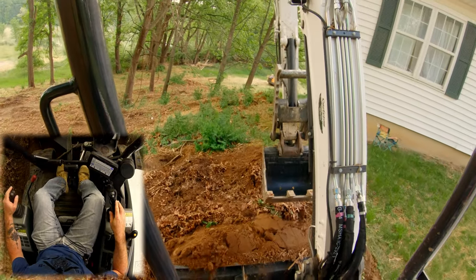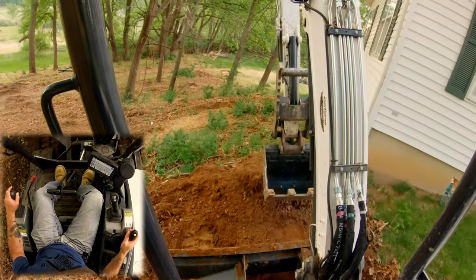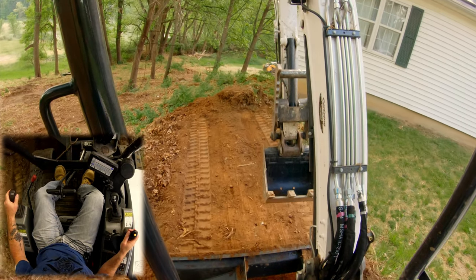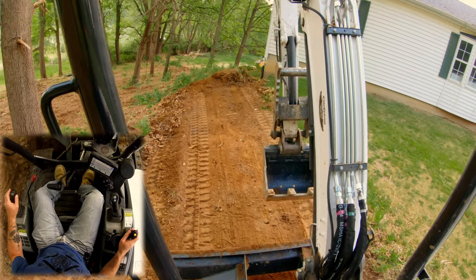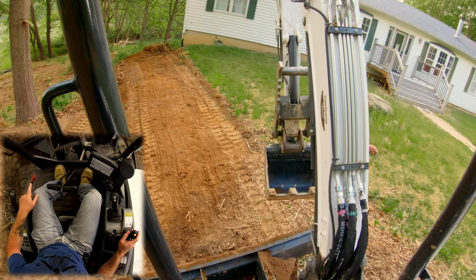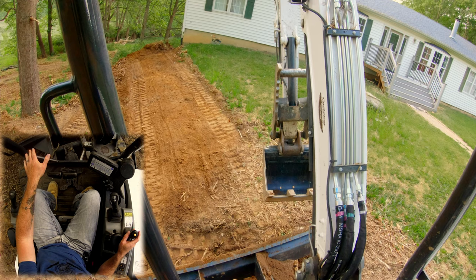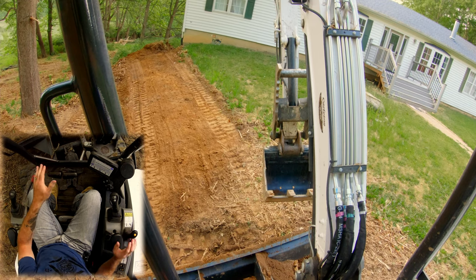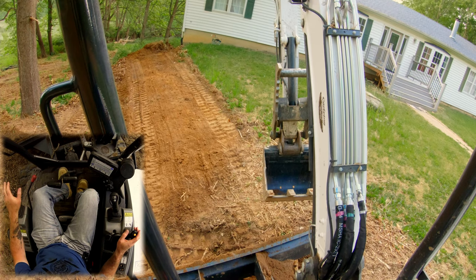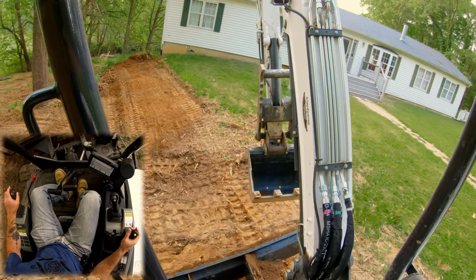I was trying to keep my boom down a little bit. They do have a gutter downspout there, I need to pay attention to that. A quick tip when you're grading with the blade of a mini: you can see there's a hard angle transitioning from the yard to the new slope I just cut in. What we can do is straddle that with our tracks, take our blade down, and actually round that off a little bit.